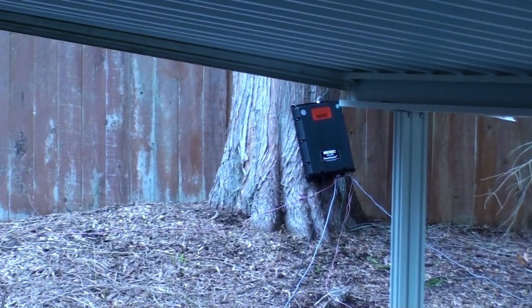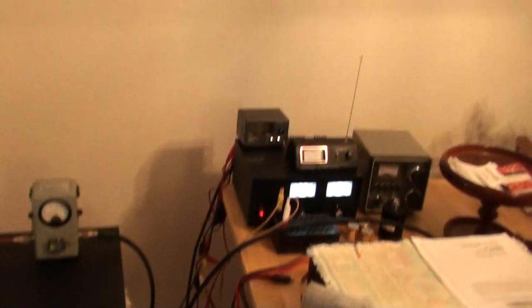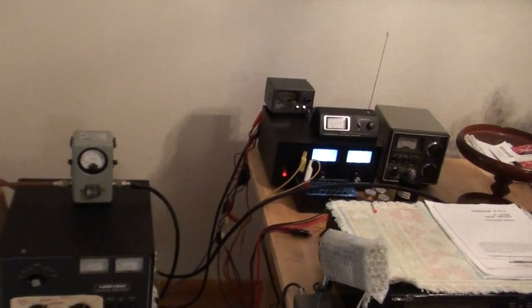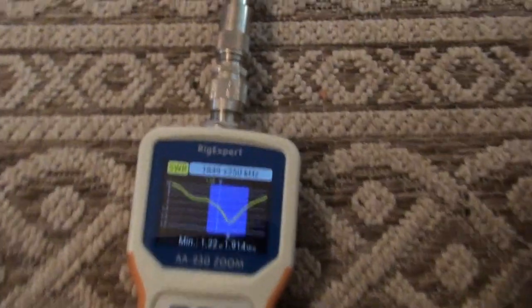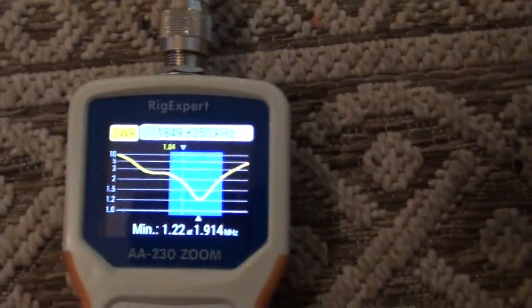That black box out there — zoom in with the handycam — that's a big giant what I call bow-tie on-end loop. 12 volts goes out of there, comes in on this CAT5 plenum cable; a couple of the wires go all the way back to this mess, and it's got 12 volts. So it would have turned on the last tuning solution I had, which I believe was 160m. Now that that's active and it's near field — within a quarter wavelength of my inverted L, actually a lot closer than that — look what it does to the SWR. We're going to simply rescan it and see what happens.